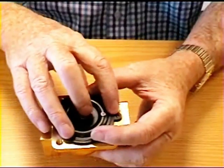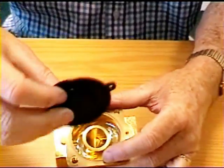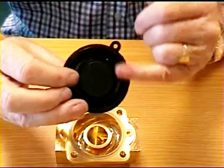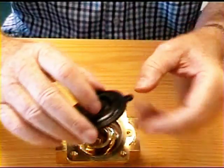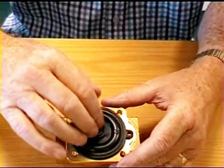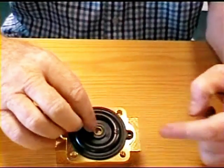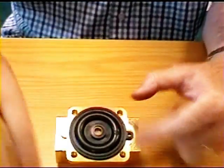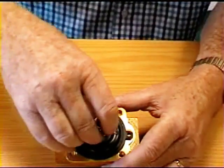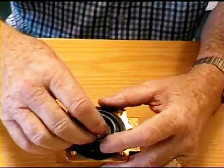This little ear goes into that neat little place there, and you'll see that the pilot hole is in there, and also in the seal there's a very small hole. The effect of that is to allow the valve to stay closed when it has pressure in it, because the pressure will come up through this tiny hole and keep that valve shut. This spring just makes sure it does close when you switch it off.